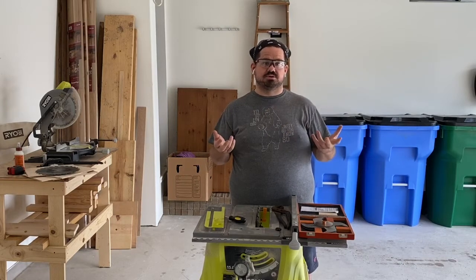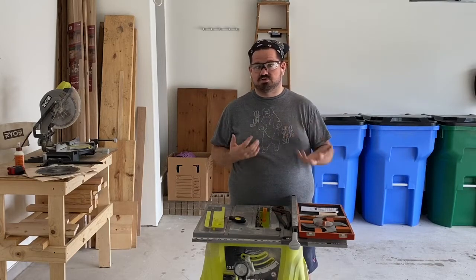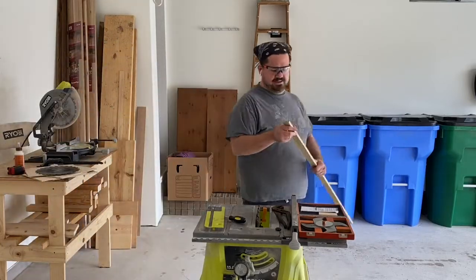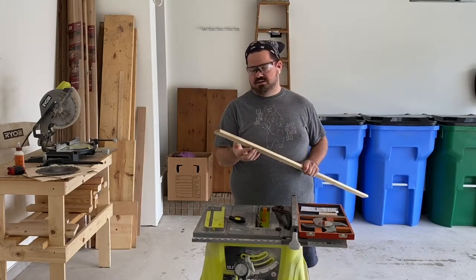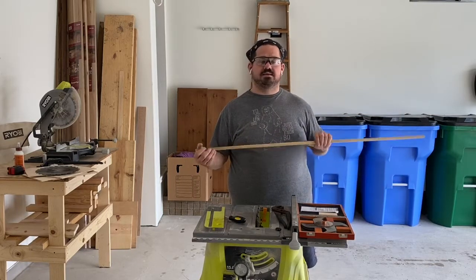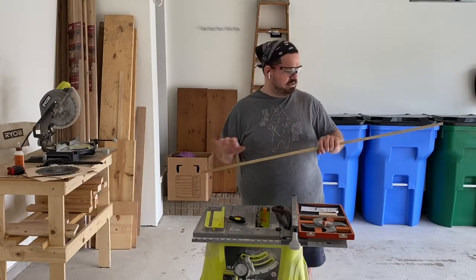So it can get fairly thick, and you use a stacked dado to do things like create the insets whenever you're building bookshelves or something like that, so it sits inside the case and it holds it up as strongly as possible. What I did was I took some poplar, of course, because I love this wood, it's gorgeous. I took some 1.5 by 1/2 inch poplar shafts that I got at the Home Depot. They were on sale, I can't help it.